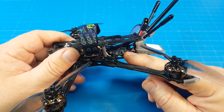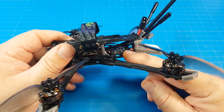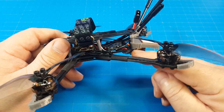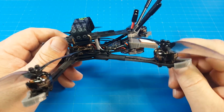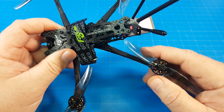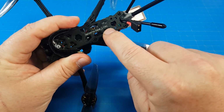The max setting that you saw in the VTX is 450 milliwatts, so that is what we were flying out there in the open field when it said A1, max, band, channel, and then the milliwatts that we were flying at. So when it says max, that means 450. You just have to check the VTX tables, and we have a nice little, you can't see all of it, inspired by Dave C FPV.